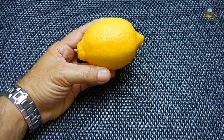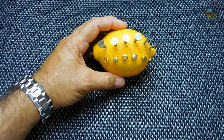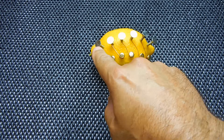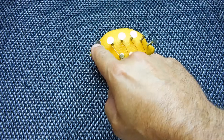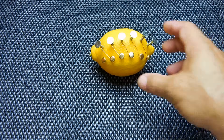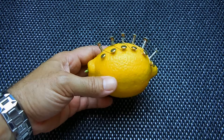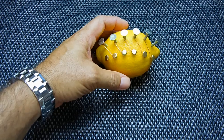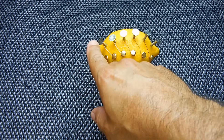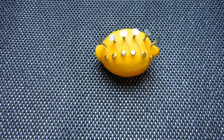So what I did is I put the same exact thing together. Right over here we have six roofing nails that are galvanized, which means they're coated in zinc. And along the bottom, we have those same brass pushpins — you could pick these up in a stationery store, they're used for holding sheets of paper together. Just like in the other video, the anode and cathode of the cells are joined together to create a series connection.